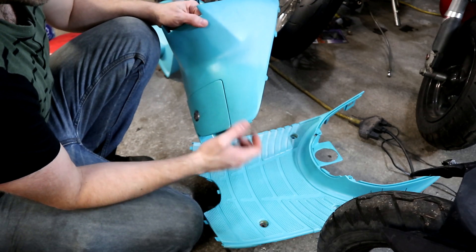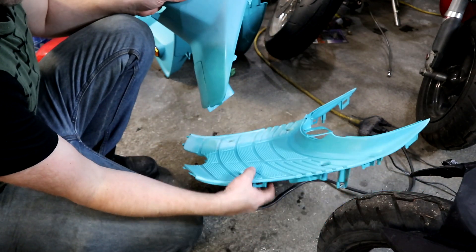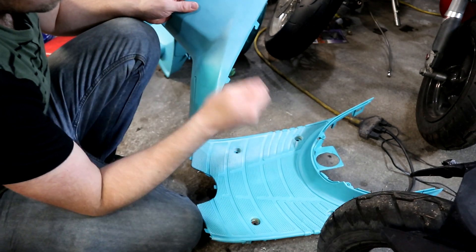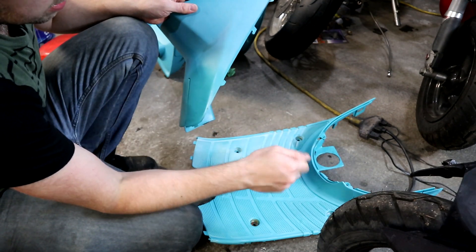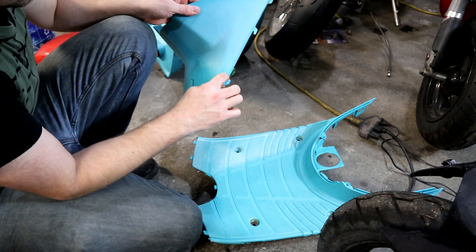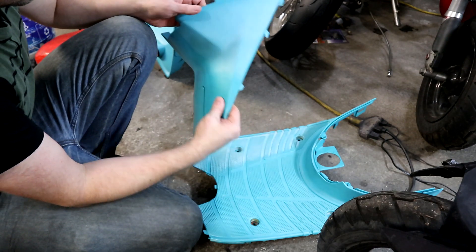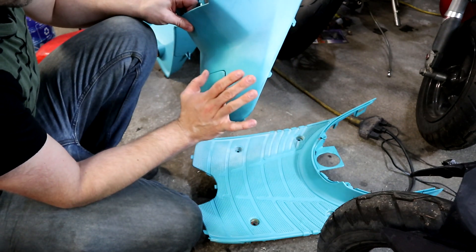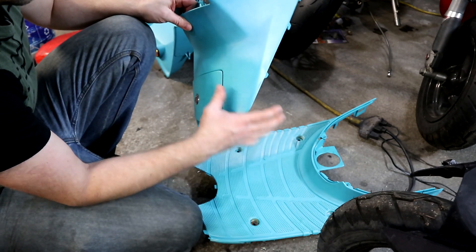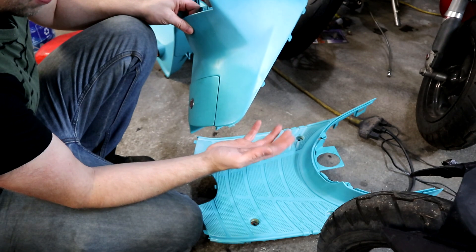There are other safety precautions to take into consideration. Thin plastics like this will distort much more readily than thick stuff. Also, be extremely careful at the edges — don't dwell on the edges. Take the heat gun and go over your edges like this, because if you dwell on them it can burn and bubble up and you'll get a black spot that you can't fix, short of sanding it down, but then you're going to lose the texture underneath. Also, when it's still hot don't touch it or you'll end up with a fingerprint in it, or if you have dirt or grit on your hands or workbench and rub it in while the plastic is still glazed and hot, you'll end up with contaminant in your plastic.